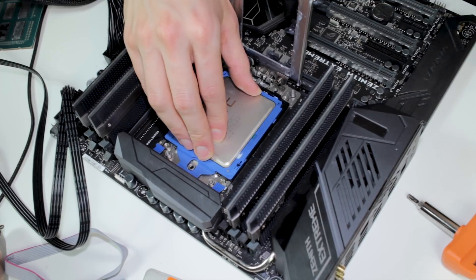There are only two possible reasons for that. Either the CPU is damaged — meaning there's a short circuit and some kind of protection is powering off the board — or there is an ID pin, similar to what you have on socket 2066. On socket 2066, if you put in Skylake-X or Kaby Lake-X, the socket can detect which CPU was put in by an ID pin — whether it's grounded or not — because Kaby Lake-X has direct V-core supply and Skylake-X has a CPU input voltage instead. So my guess would be either the CPU is damaged or there is some sort of ID pin, and we can actually check that.